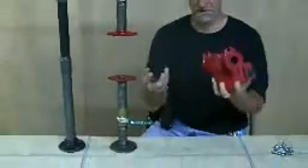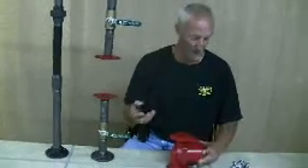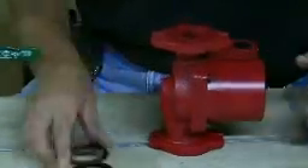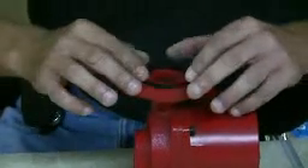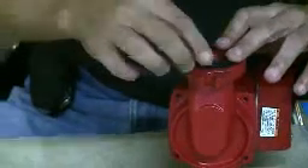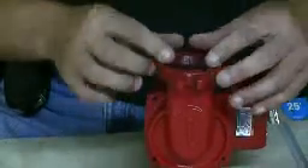The gaskets fell off of this one. Now we'll pretend that I'm going to put in the brand new one — I'll use the same pump. You always want to use a new pair of flange gaskets; never use the old ones. What you want to do is take the flange gasket and put it in the groove of the pump and press it in place. And of course, you do it on both sides. Make sure that they're flush and flat — they shouldn't fall out.